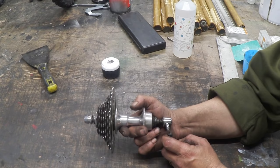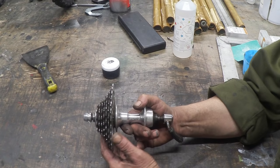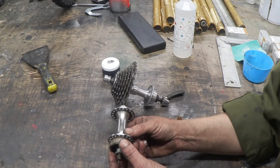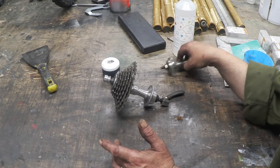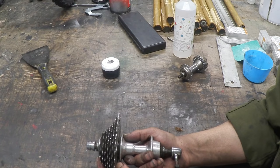When we look at a gear cluster on a bike, it's actually two sleeves of metal with a pawl and ratchet. The pawl and ratchet allows you to drive it in one direction with the chain, but the ratchets fall back so it freewheels the other direction. The outer sleeve has the gears attached, and the inner sleeve has the axle attached. The axle has a threaded stub that the inner sleeve screws onto — that's what drives the inner sleeve. The outer sleeve is driven by the chain.